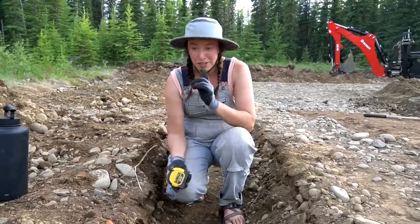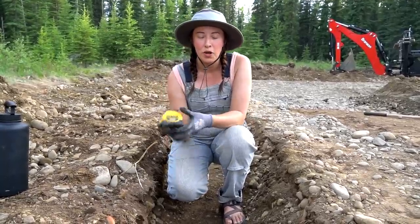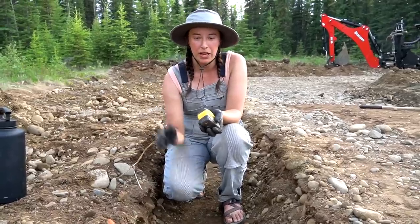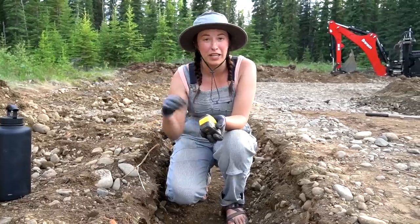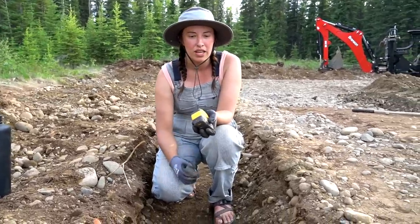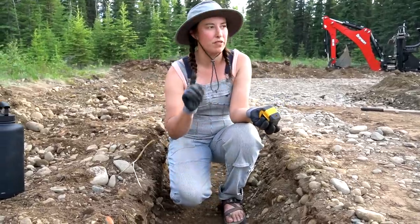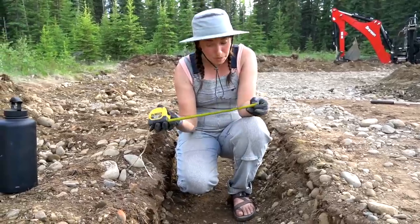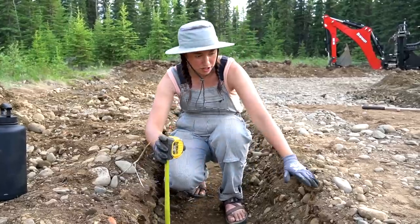Well, I spoke too soon earlier. This took a lot more energy than I anticipated. We learned that we took too much out of these trenches and we had to spend a lot of our time backfilling it. Eric was able to do some of it with the tractor, but we had to do a lot of it by hand. And then we tamped everything down. So on the positive side, this hole, it's almost finished the perimeter, but we know the exact measurement. It's almost perfectly 12 inches the whole way, which is awesome.